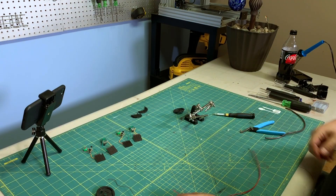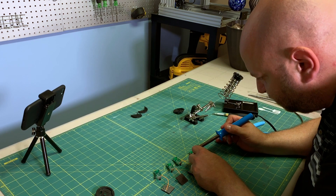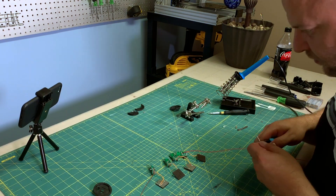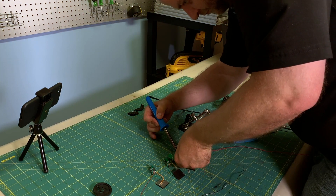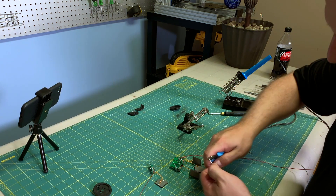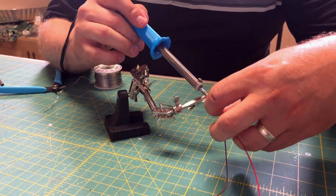I've removed the LEDs and connected the solar panels back to the boards. Now I'm going to add jumper wires so that we'll be able to connect it all up in series. That's going to combine the voltages of the panels and also combine the voltages of the batteries, so that once the batteries are charged and running on battery power it's going to supply 3.9 to 4.5 volts instead of one to one and a half volts. These little solar lights are quite ingenious — there's a little charge controller that turns the light on only when it's not getting a good enough supply from the solar panel, so it only shines in darkness, and when it's bright outside the light is off and the battery is recharging. Together they'll function as one panel but with a higher voltage.